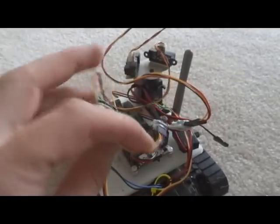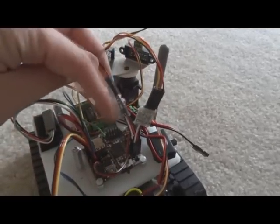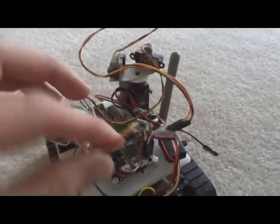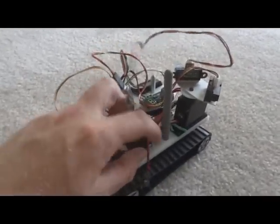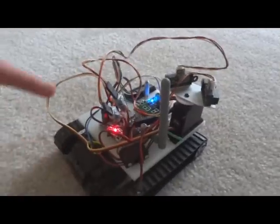The Sharp IRs release an output voltage that's a little too high for the Axon Mote, so there are two voltage dividers I've attached right here and here. Now I turn it on — there's just this on switch and it's all on, as you can tell by the LEDs.